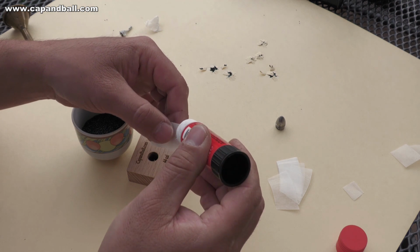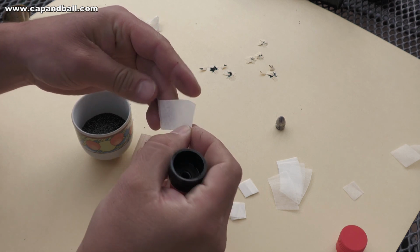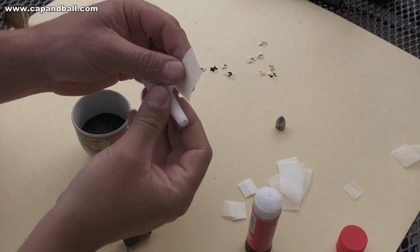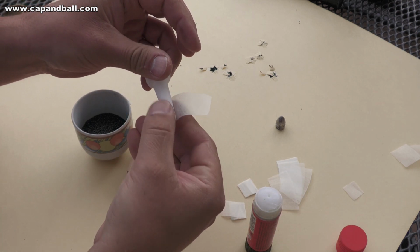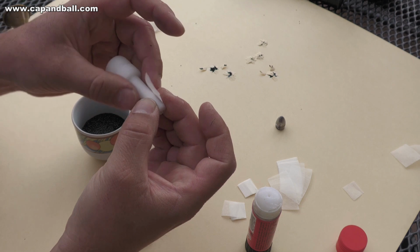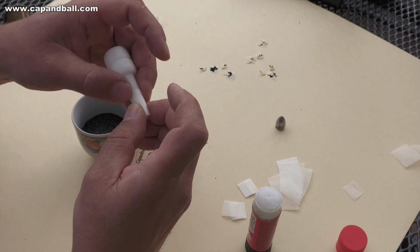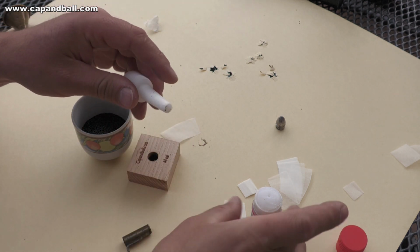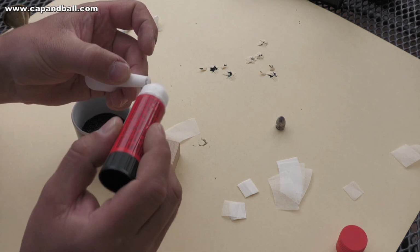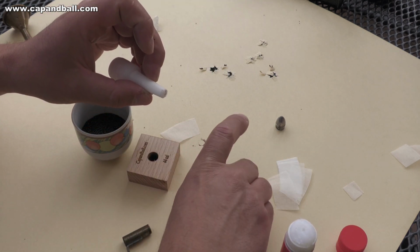Forming the cartridge with our former is piece of cake. If you have experience, you can roll one cartridge in a minute. The paper I'm using is called hair curling paper, but any thin paper will work without nitrating. The pre-cut sheets with some glue on one edge are rolled on the dowel first in one layer. When we are done, we apply some glue to the base of the cartridge to accept the closing sheet. This small piece of paper is cut from the same kind of paper as the envelope.